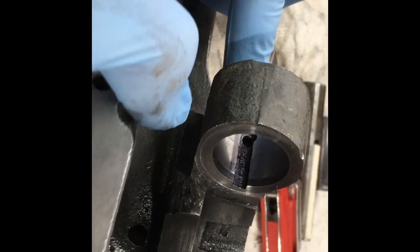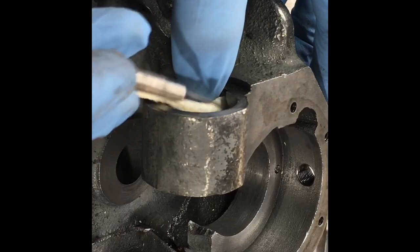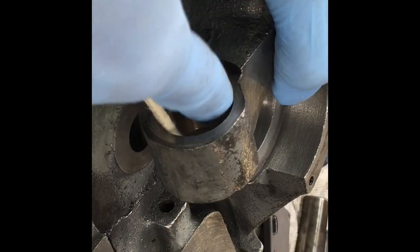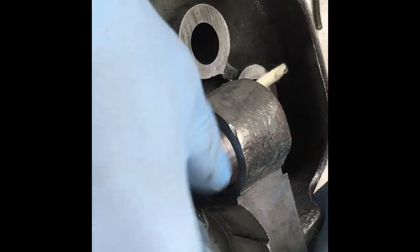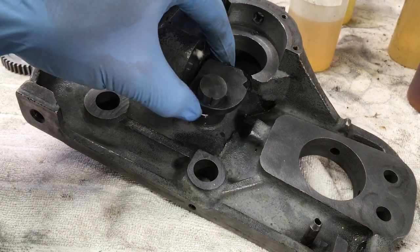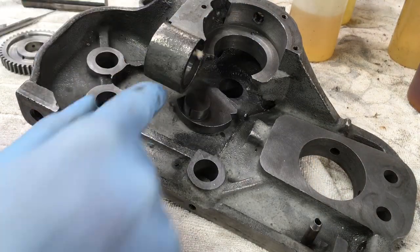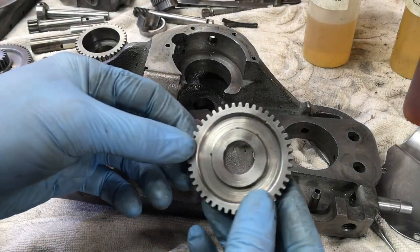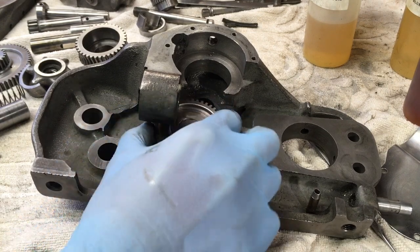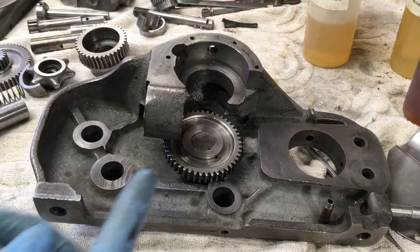Okay, we've got those. There's a hole down in there - that hole goes down into the reservoir. Put it on the end, shove it down in there, it's pretty easy - lay it flat down into the keyway. And that's it for wicking. So this is the first part - this is the cam that goes down in there. Just put a little bit of Type C on it, engage it with the hole and let it drop in. Then take the second gear - this is the change gear which goes up to the power cross slide - and drop that in there.